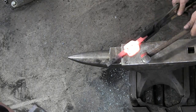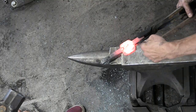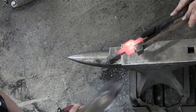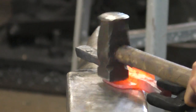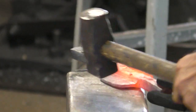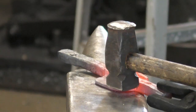So I'm going to tip the tool in, but I want you to hit not this way, but right, the outside edge of the top. Okay, yeah. Something like that. Yep. See how the tool doesn't skid out of the work? You're driving it down and in against the corner. So, excellent, excellent.